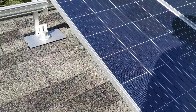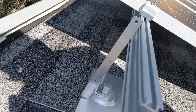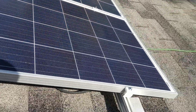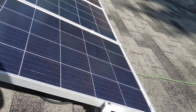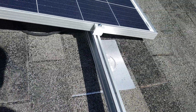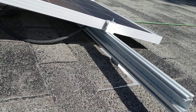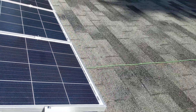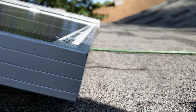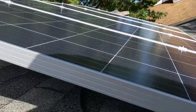What I found out — I started by discovering that the one-inch angle aluminum I was using just wasn't mounted right and wasn't strong enough against the rails. So I switched to one-and-a-half-inch aluminum angle. And what I ended up figuring out on that is that these rails right here are not actually strong enough to handle the weight. The rail itself was actually flexing, and even now I don't know if I'll be able to show this very well, but even now it actually can't quite hold it perfectly flat.